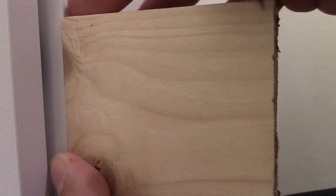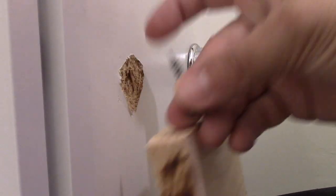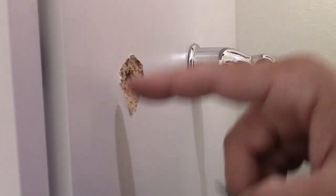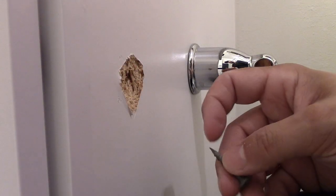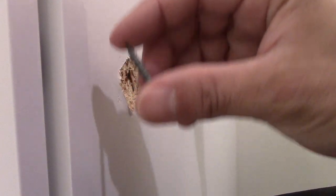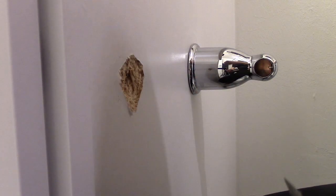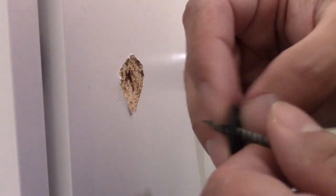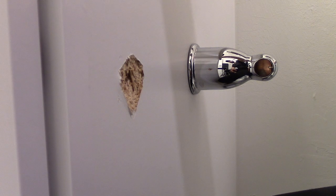The piece of wood I'm using is three-quarters of an inch, which is the same thickness as the face frame — all face frames are three-quarters of an inch in most cases. If you use a screw that's too long you're going to see the tips protruding on the outside of the box. Make sure you use the right length screw. I'm still a bit concerned about protrusion, so I'm going to use some plastic washers from a TV mount I installed just to prevent the screw from going all the way through.